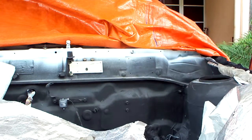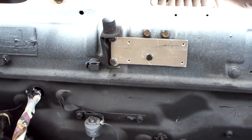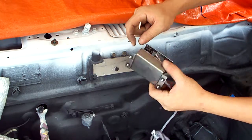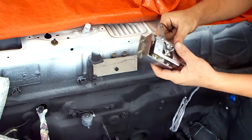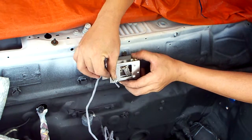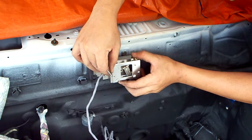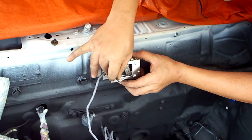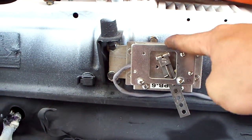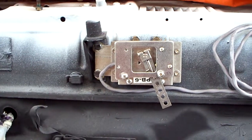Okay man, rock solid. So it is fixed, and I've already tapped the M4 screws there. So I'm going to put up the pot box. For the pot box, I've added a sort of rubber washer to keep the spring and the washer in, so I don't have to run around hunting for the washer and spring in the future. Plus it's going to be sort of dampening. So there you go guys, the pot box is in, rock solid. So I can fix the cable on, it should work fine.